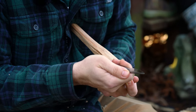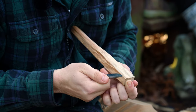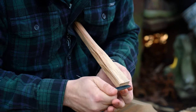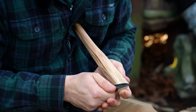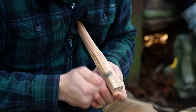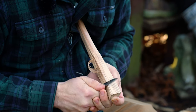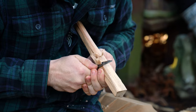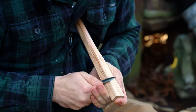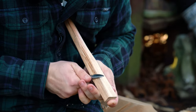The blade is facing away from your body — it makes a lot more sense than carving like this. I'm just going to engage the wood nice and slow. You'll see immediately my fingers want to jump up and start helping, which is fine — that's what you want to do. Thumb is out of the way. These three fingers are on the back of my carving hand assisting with control and a little bit of strength. You'll notice that I do some windshield wiper motion, but if I get close to my body, we're always going to keep the blade facing out.